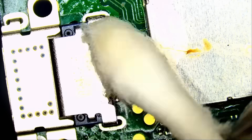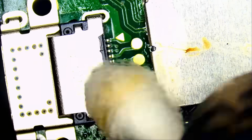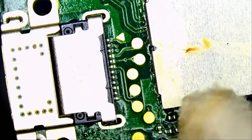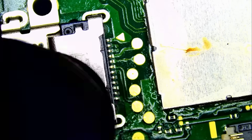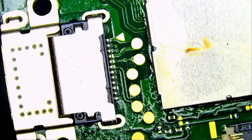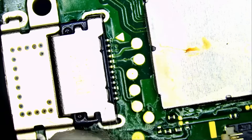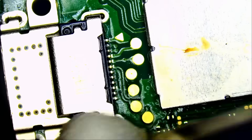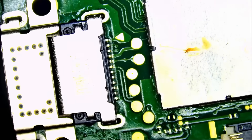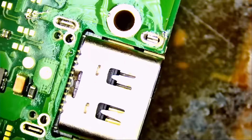We're done. All we have to do is solder the legs from the bottom, hand it to big bus to reassemble and test. I'll do a quick visual inspection on the M92 chip and the BQ chip. A short circuit on this connector could have caused something else to fail — it might go from fixable to not practical or not economical to fix. We can't say it's a done deal until we try it.